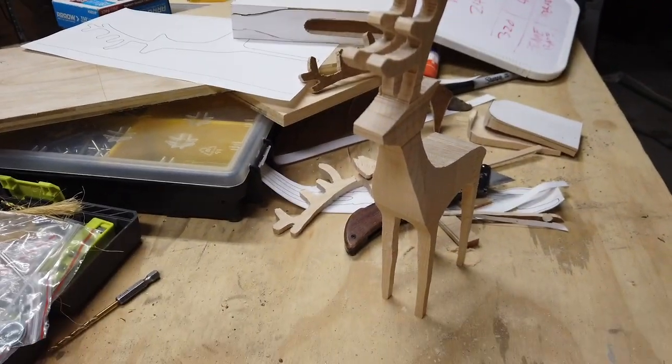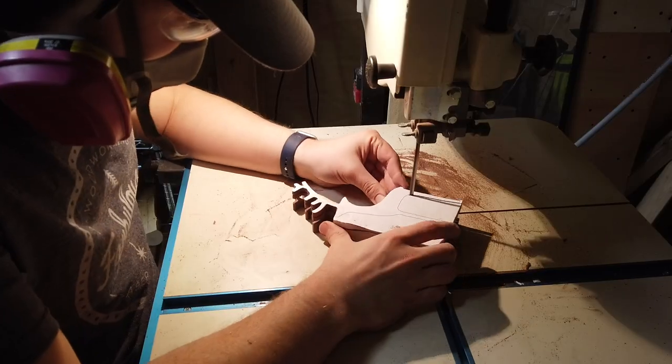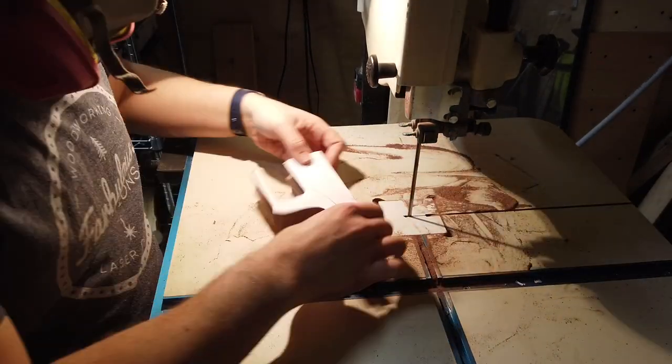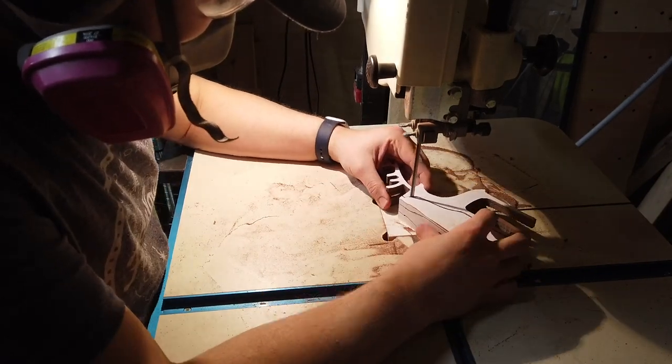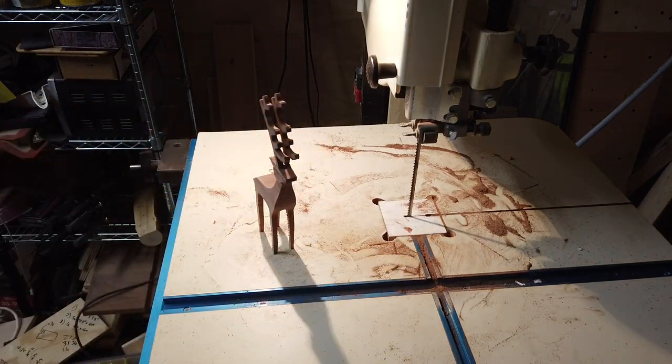This first one came out a little rough, as it was my first time using a bandsaw in months, so I was a little out of practice. The smaller one — the one made out of walnut — went a lot smoother on the bandsaw. I didn't forget to cut anything, the hot glue was where it was supposed to be, and I had a lot smoother and cleaner cut lines from the bandsaw blade, all of which gave a much more satisfying reveal. In my original version of the template, I had added slight details to the front profile to give contours to the head and neckline, but these ended up looking like accidental defects in the final reindeer, and I ultimately sanded them out, so I'll be removing them from the downloadable template.